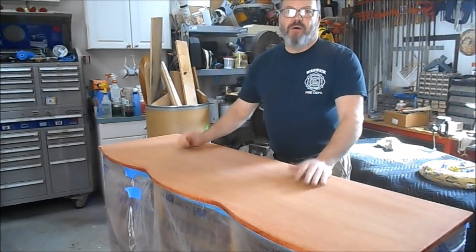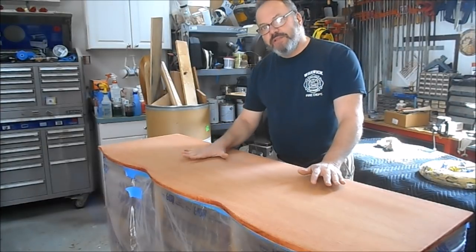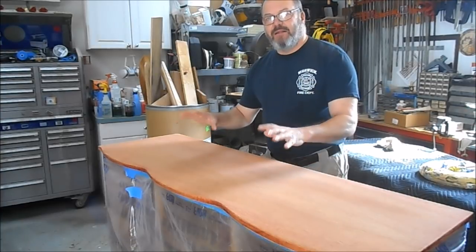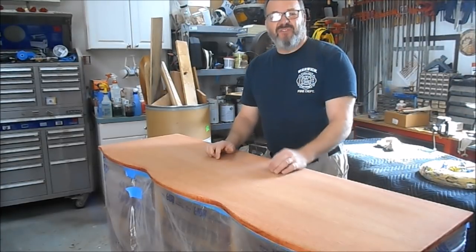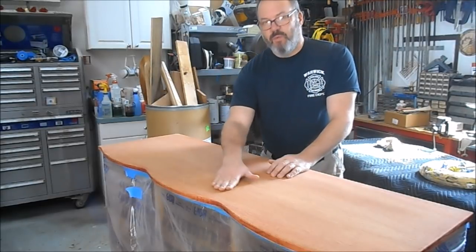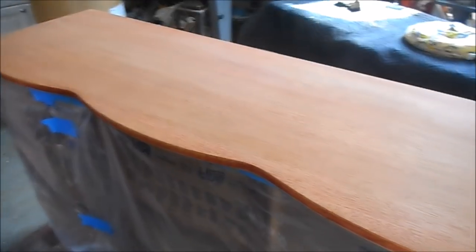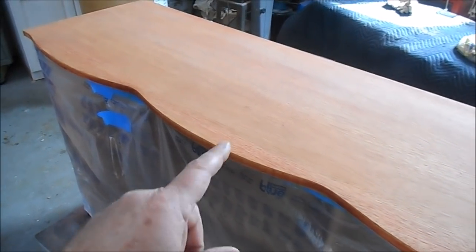We're back — it's been about 20 hours and we're ready to move forward. The next step is to sand it lightly with 220. Remember, it's a veneer top and we've already sanded it once, so we just want to knock down any grain that raised from the water in the oxalic solution. Then we'll get it sealed up. Reviewing the footage from yesterday, I realized the shadows outside kept you from seeing detail, so I'll show you what we're dealing with now. Here's our area — it has just a little bit less red than the surrounding area, but the oxalic got us an awful lot. I'll hand sand with 220 and then seal it up.